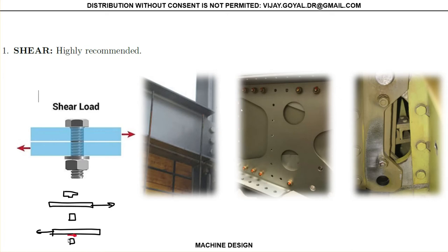Because of action-reaction, you're going to have a load in this direction and a load in the opposite direction. You have loads acting in the same direction with a resultant there — internally they cancel out. This is a shear joint, and you can appreciate the joints that are shown here.